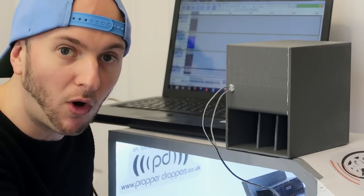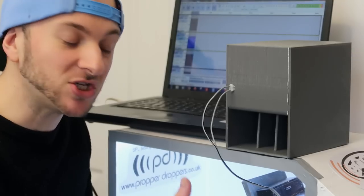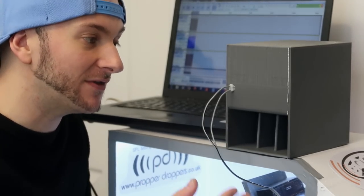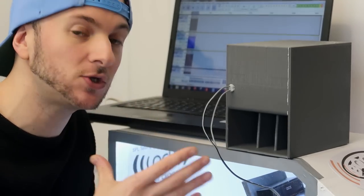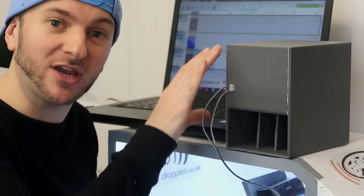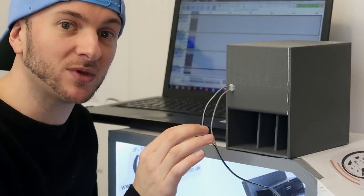And also I can see on the watt meter here, which you can't see right now, but it's so efficient that it wasn't registering any watts. It just said zero on the screen there. And that shows me that the cone is just properly going crazy, and it's super, super efficient at that frequency. I suspect that the air spring in that seal chamber might actually be aiding this specific frequency, which is on an unload.